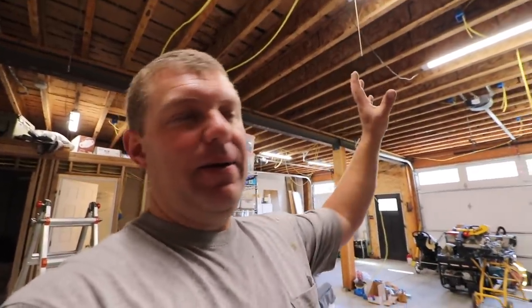And then I'm wanting to do the same thing up here in the ceiling. We've got all these boxes you see with the pigtails hanging down. Those are actually going to be outlets, and these lights have a cord that's going to plug into them. The reasoning behind that, if you want to know, jump back. We talked about that in a previous video working on this project. So I'm hoping to clean up all these dangling messes today and actually get them terminated into something. And that'll help me finalize the wire pulls and start getting things cut to length and tidying up here. And then if we get that far, we'll start working on securing all this wire.